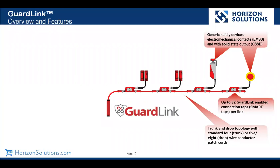We can have up to 32 GuardLink taps or GuardLink inputs per link, and we allow up to 1,000 meters of link distance overall with a maximum of 30 meters between the taps. And then each tap can have up to 10 meters from the tap to the switching device.